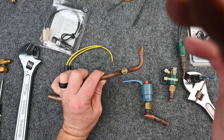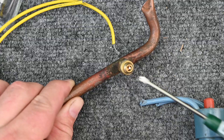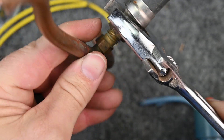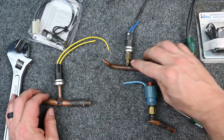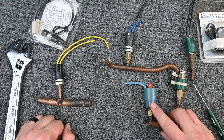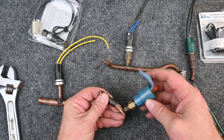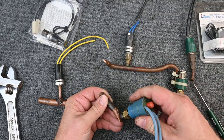This one has a Schrader port inside, which is great. The Schrader valve stops refrigerant from coming out, and this one has a Schrader depressor inside — a little knot that pushes it back. So I could change out this pressure switch easily if it went bad. This is a good win. I like commercial units because they put a tag on there saying there is a Schrader valve behind there — not all of them have that, though.